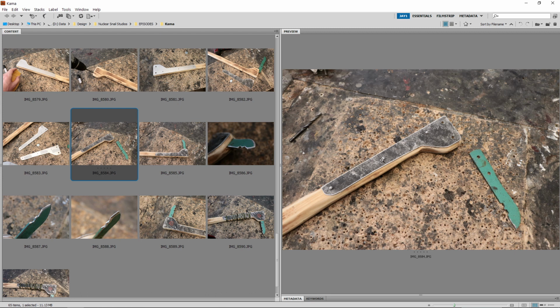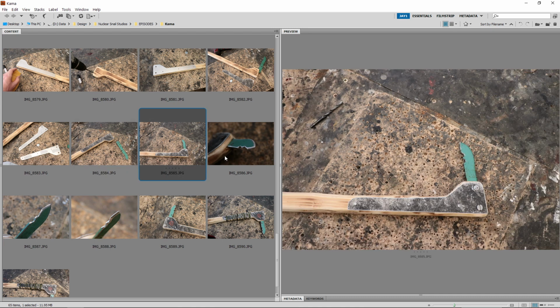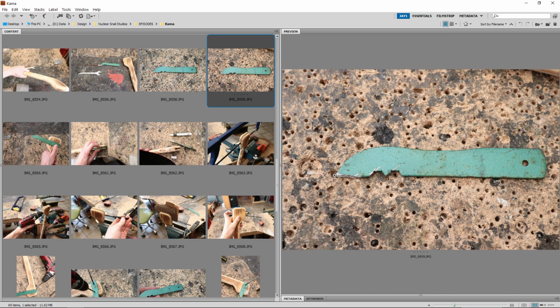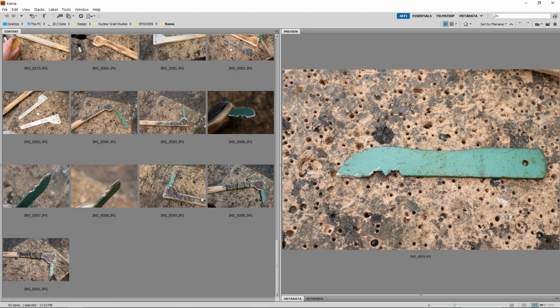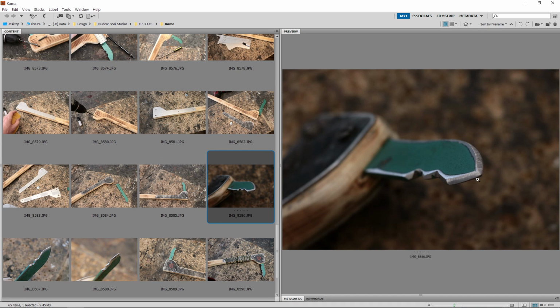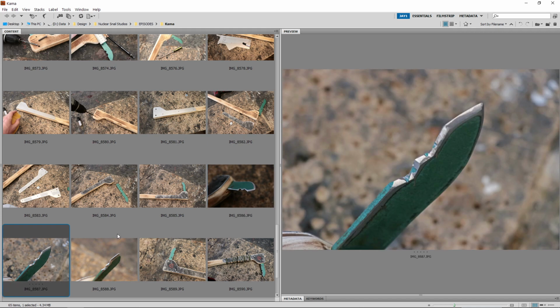So you can see here I already added the 3 small bolts, and now it's the time to attach the head. I use 2 bigger bolts here. I do not use any washers here because the languet already acts as the washer. And then I change the blade geometry a bit, so you can see that the point is no longer down here. You can see that here the point is in line with back here. Down here it no longer is the case in the final, because that is the optimal point of impact, as I found out by striking a couple of boards. So there is that. Now, sorry, this is not a good blade geometry by any means. It's just, you know, a rough zombie apocalypse rush job, and that's fine for what it is.